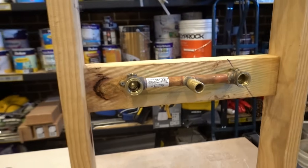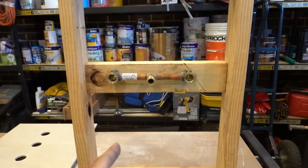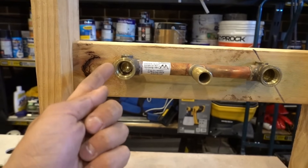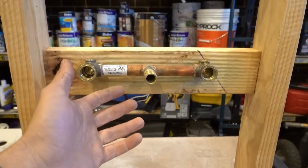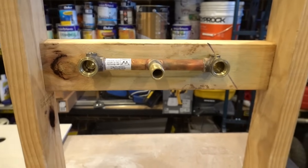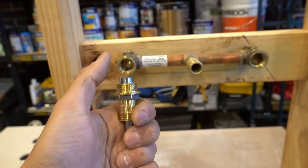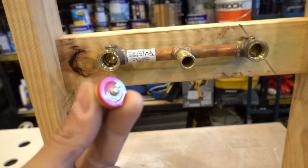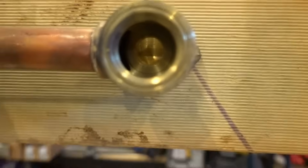That's another main cause addressed. A very important thing to do before we move on to the solution that's going to save you thousands of dollars: anytime you shave down the tap seat, you need to flush the system to get rid of those shavings. If you've got an aerator, take it off; if not, take off the whole tap or shower head. Make sure you remove it and flush the system. Also, when you put your spindle back on, make sure it's in the open position so the tap washer is all the way back and not pressing up against the seat — that prevents debris getting stuck on the washer and causing damage over time.